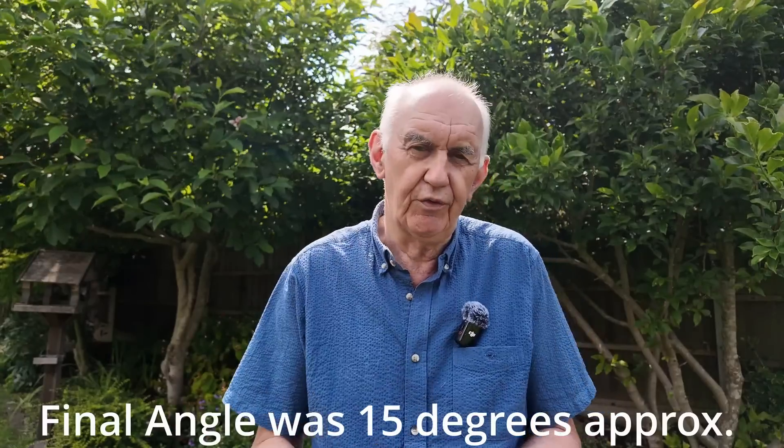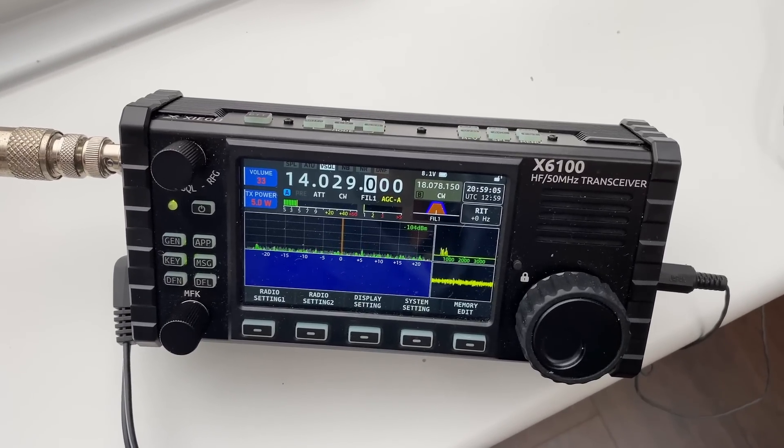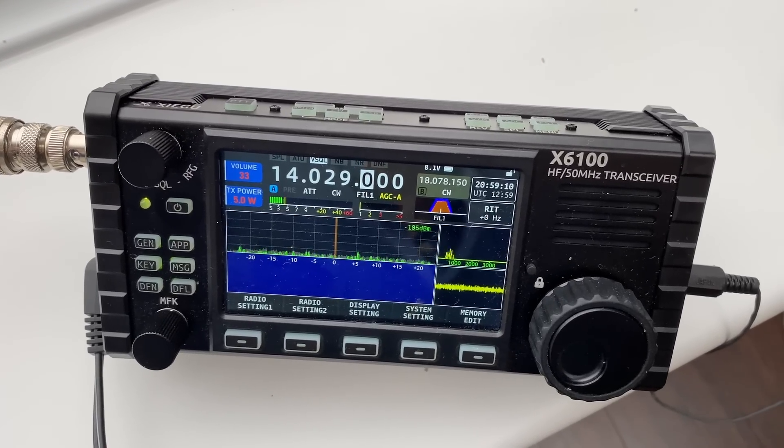So I reasoned that if we were to angle the radial near the ground or on the ground at the feed point, but then pull it off the ground at an angle of around 30 degrees, the most of the radial would be above ground and we'd probably get similar results to raising the antenna off the ground. I did some interesting tests last night — it was about quarter to midnight on the 20-meter band, which supposedly was closed. I couldn't hear anything at all running QRP from the X6100, and I had my vertical antenna outside with the radial pointing in an easterly direction.